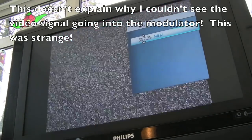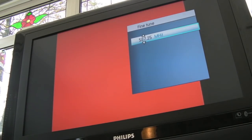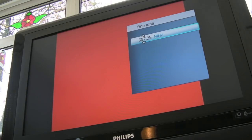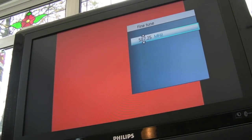After a bit of detective work experimenting with the modulator - I thought it must be the modulator - I just tweaked the TV fine tune, and you can see we do actually have a display there showing different colours. Now that might indicate a fault, maybe RAM or something like that. It's definitely got some sort of failure on this board. It could be corrosion causing the failure. I'll connect the keyboard up and try to clear the CMOS to see if that makes a difference.